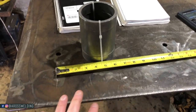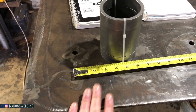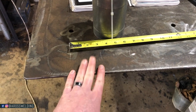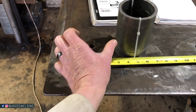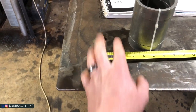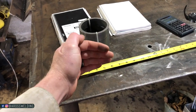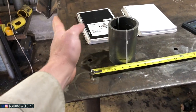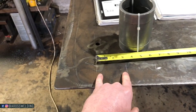The only reason I'm explaining all this is to keep in mind to account for everything that's going to be taking away space in your gate opening. That is my ultimate goal here. So now there's always the case of this piece of flat that I'm putting on here. Yeah, I'm considering putting it 3 inches, but if for some reason my gates were touching, I could always trim 1 inch off my flat. As long as whatever you're mounting your gates to, like if you need them to swing around a certain way or a certain distance, you want to make sure you have this long enough to where it's going to reach or fold back or whatever you need that gate to do. You want to make sure that's long enough, I guess is what I'm saying.